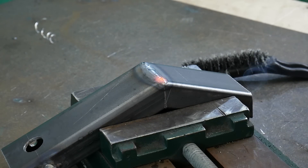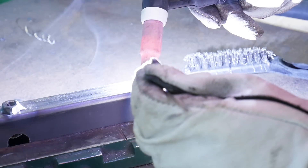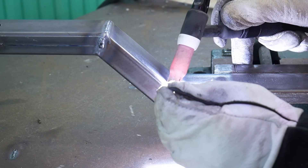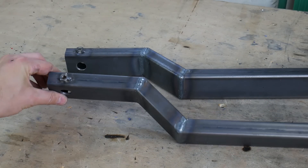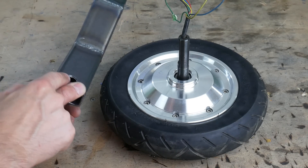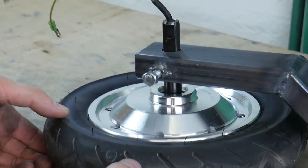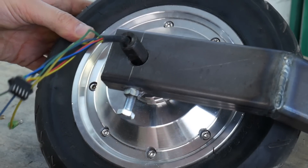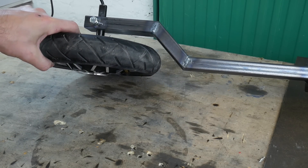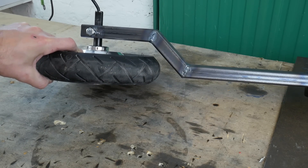There are some funny angles to make here. I've got a bit of a crank in the upright so I can get the hoverboard wheel directly below the pivot point. I've got some 45-degree angles — 22.5 degrees cut in that box section — and that welds up to make the 45-degree angle. What we end up with after welding all those funny joints is a kind of crank-shaped piece, and that means the hoverboard motor can fit directly below the main upright piece. I'm using 10-inch hoverboard motors which have a pneumatic tyre, and that fits into the big hole I drilled, with the bolt going in the other way backed up by that nut so it grips the flat on the shaft. The hoverboard motor is directly in line with that upright shaft and everything will rotate on the spot.